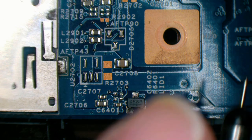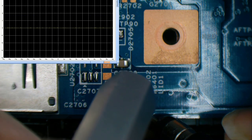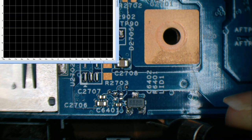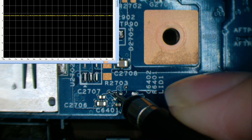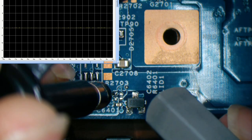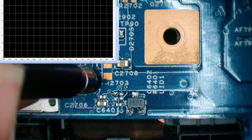There's a pin with no signal and a pin with voltage. Let's grab a magnet and bring it near to see what happens. Move it away, come back, and you see the signal being pulled to ground - so we know that is working. But is it getting to the processor? It almost certainly follows the trace under to this resistor and then over here. We'll check on that test point, probe on it and bring our magnet over - and that's working. It's getting through the resistor.